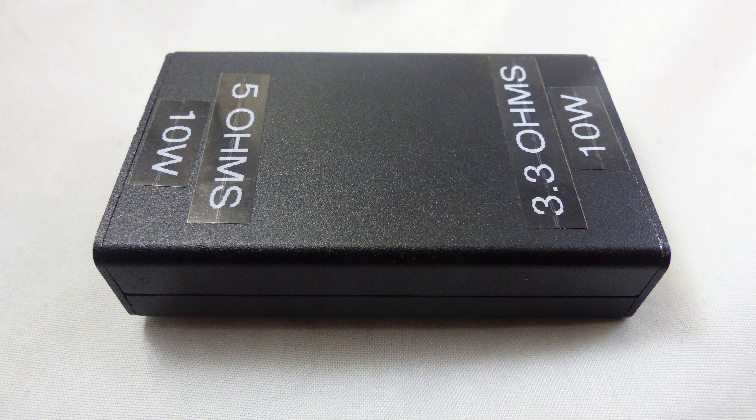This should be plenty good enough for doing rough power supply testing, and if you're building your own DC-to-DC converter it's a good way to test that as well. Pick your own resistor values if you have different voltages you want to test. Having something small and handheld that doesn't require setup or menu navigation is very useful.